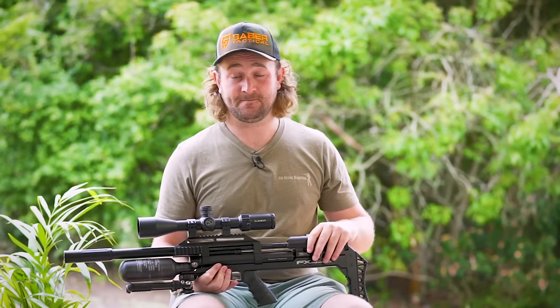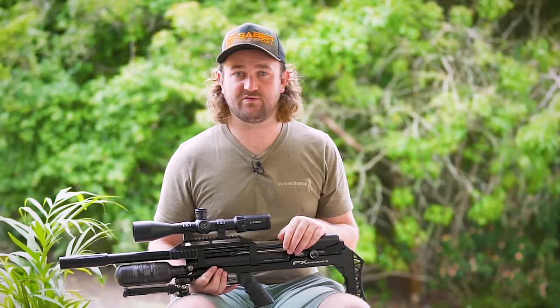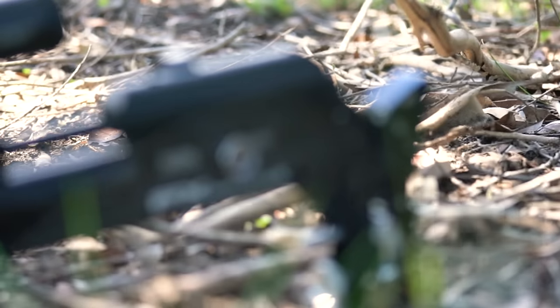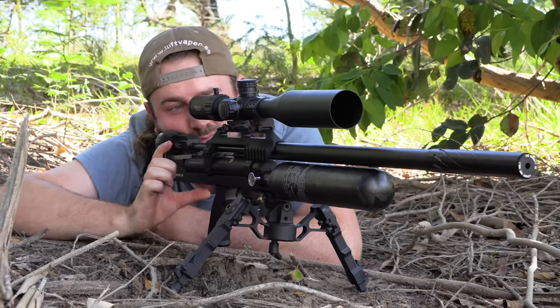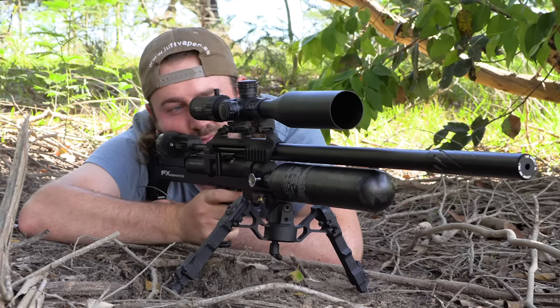But nowadays with slugs, different barrel lengths, and the capability to change calibers, we expect a lot more from our guns. We've got to be able to go from maybe 80 bar in a sub-12 foot-pound .177, all the way up to 180 or 190 bar to shoot very heavy slugs — that's more than 100 bar difference. It's just very unrealistic to expect your regulator to work that hard across such a variety of pressures without problems. For example, filling to 250 bar with a reg set to 80 bar means 170 bar of pressure differential, making reg creep very likely.